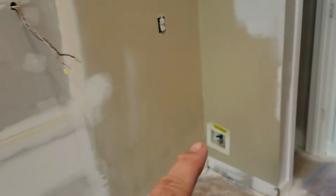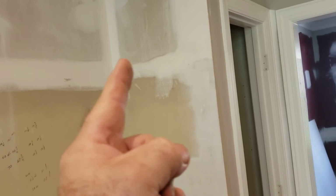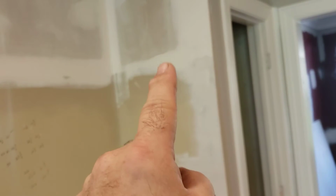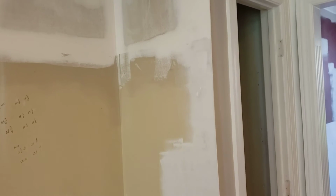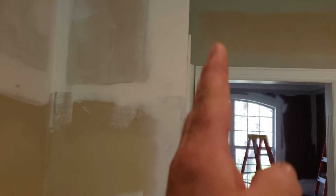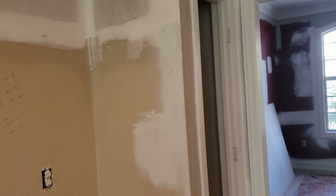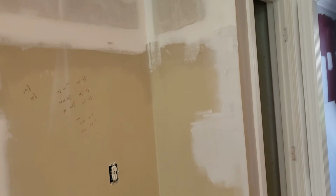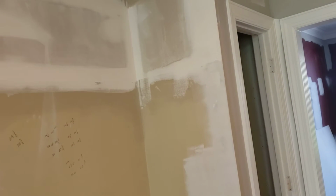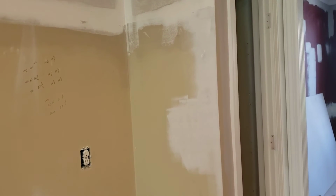If you take a look over here, this wall is 23 3/4 inches. So a 24-inch cabinet would actually hang out past the front. We need to make sure we reduce the depth of that cabinet to 23 inches, and then we'll pad it forward with material till we get to the front edge of the wall. If you take a look up through here, the wall has got kind of a kick to it, a little bow to it in the middle. So we definitely want that extra inch in there so we don't have to worry about that. Now, ideally, a 21-inch deep cabinet would work better there because you actually have room for the crown molding return above it, because again we need about 2.5, 2 3/4 inches for the crown return.